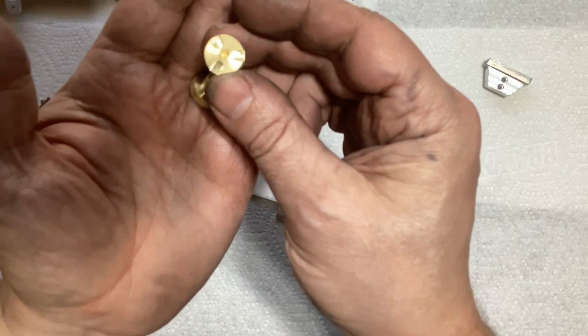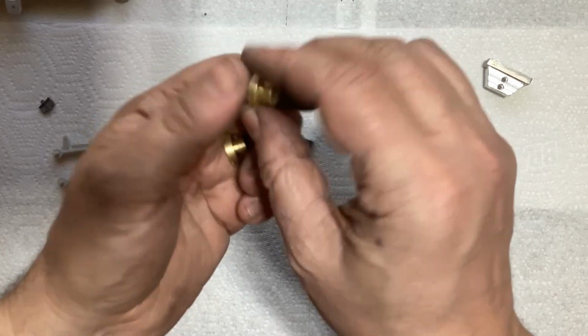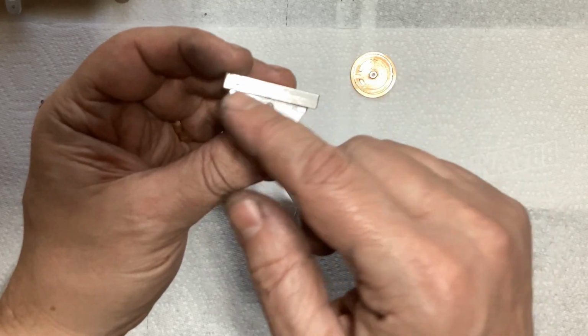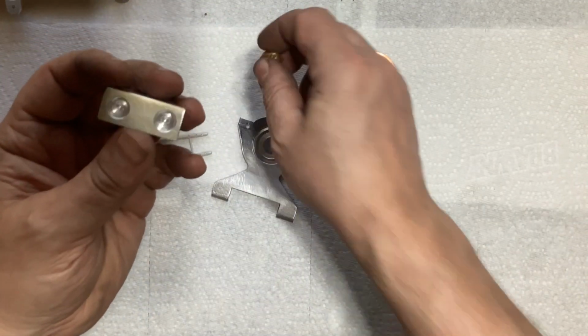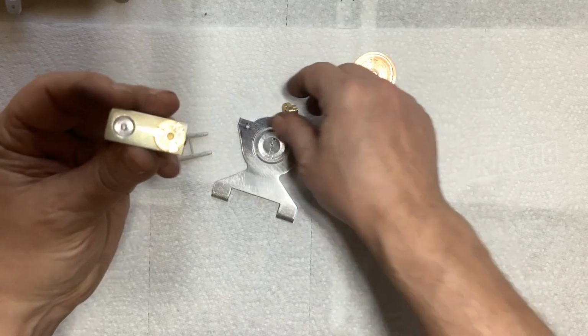They were just turned to brass on the lathe and then put on the mill to make a little design on it. And then I just milled out this block of aluminum. I didn't record it, just a simple block. Came down 3 millimeters, put some angles in it, bored some holes. So these will now kind of press right into there.